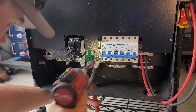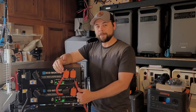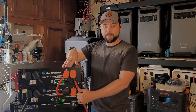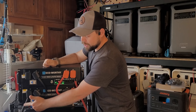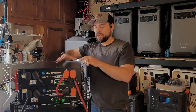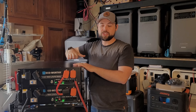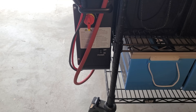I came up to the batteries and chose to put my positive cable on the top battery on the open terminal, and my negative cable to the bottom battery on the open terminal. By doing that, you make sure that you are charging and discharging the batteries equally.